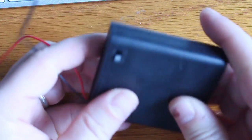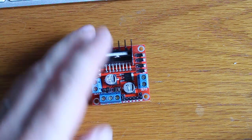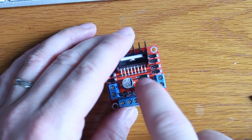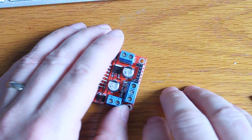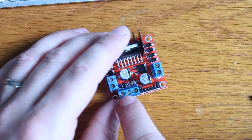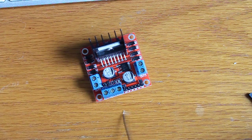What we're going to be using today is a little battery pack with nickel metal hydride batteries. The four of them together produce about five and a third volts, which is enough to run this little driver. This module can take up to 12 volts, and if you go over 7 volts, it will deliver 5 volts out that you can use to power the Arduino. In this case we're putting in 5.3 volts, so the dropout is too high to run the Arduino off here — we're just going to run the Arduino off USB. But we could also run the Arduino straight off the battery.